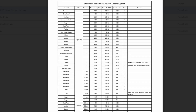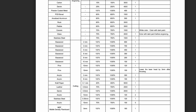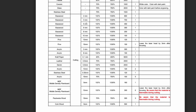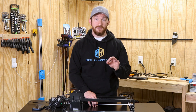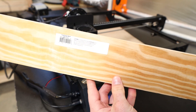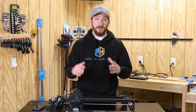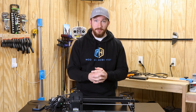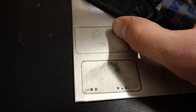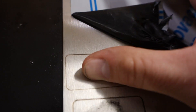I found the recommended settings useful as a starting point, but pretty much across the board this machine isn't as powerful as they say it is. It was supposed to cut through 15mm pine in a single pass, but it couldn't even get through 13mm pine in a single pass, and barely made it through in two passes. My first thought was that the pine was a little too wet, but I didn't have any luck with stainless steel either — it had pretty much no effect at the recommended settings. The engraving just wiped right off, and instead of cutting it, it just marked it.